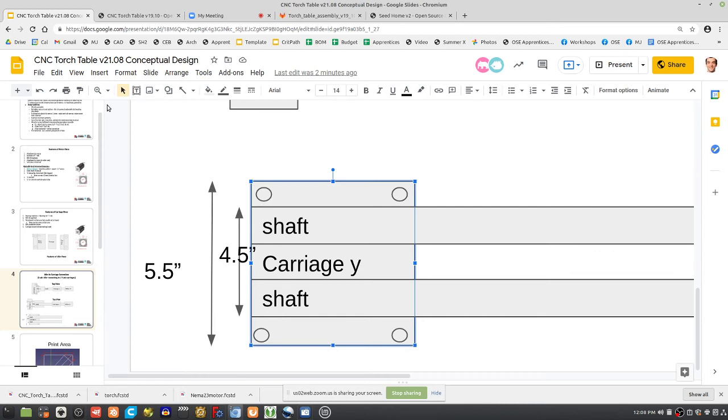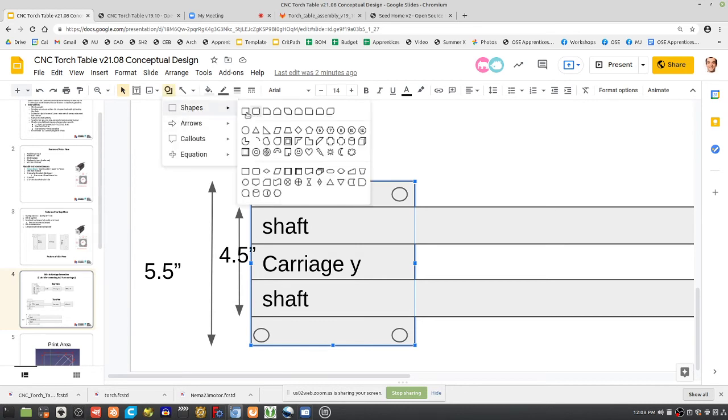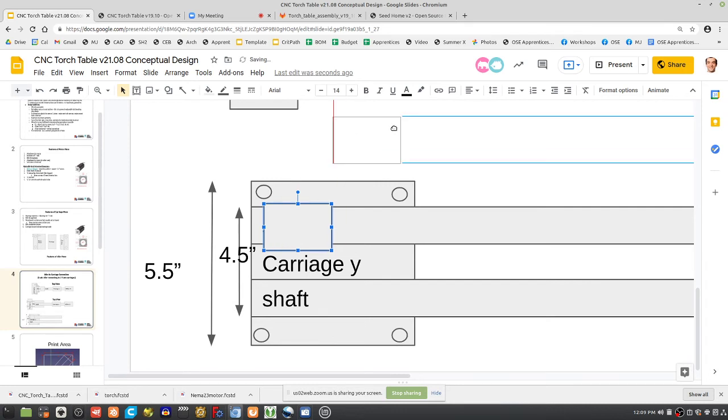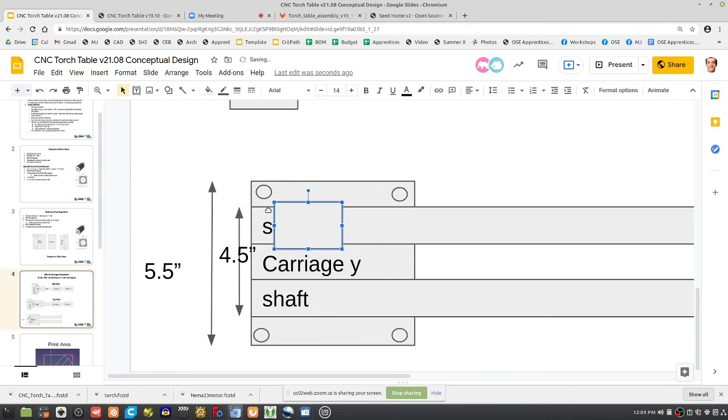Yeah, this could still work for the idler piece, because check out, do you see the issue with the carriage piece? In the carriage piece, you also have bearings, so the hole would have to be above that bearing. But I think we can still fit it. We can make it fit. You see the issue? Let's work that, and let's rework the size.